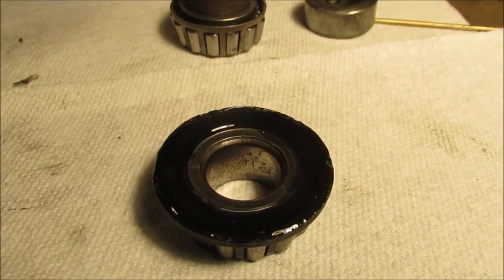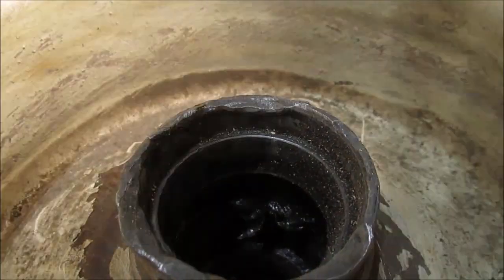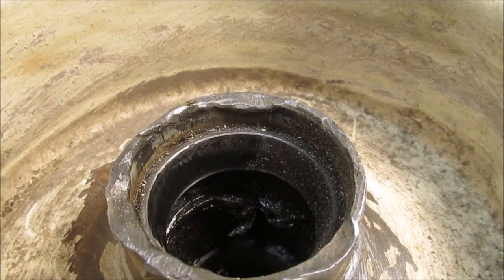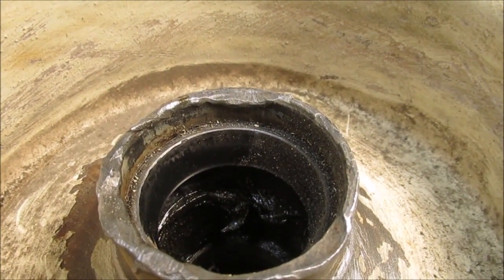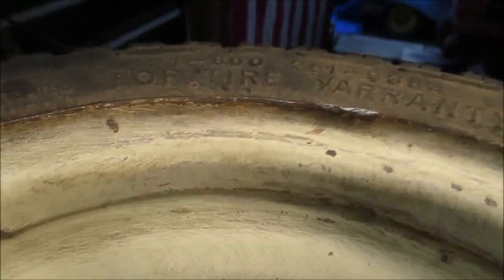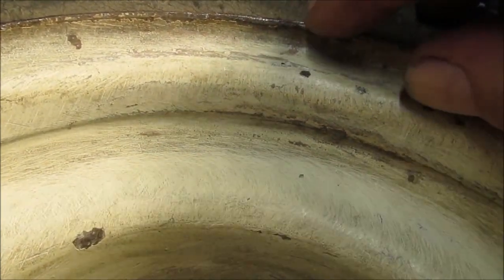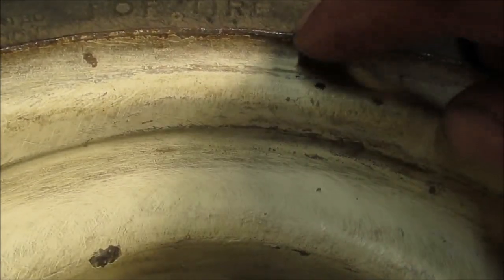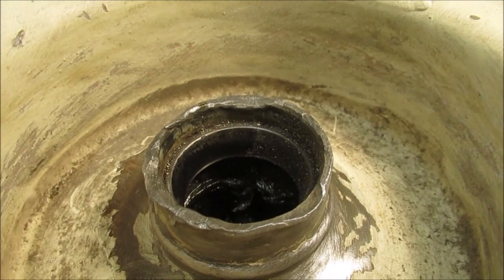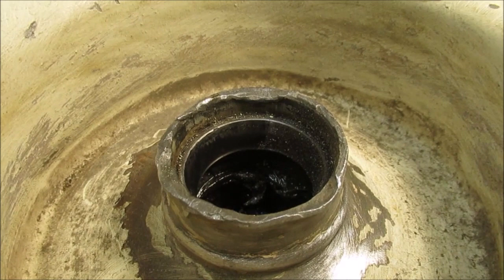We have some damage to deal with — wait till you see the bearing cap. We're gonna drain that out. We may epoxy the cap back in if it's loose — we'll pry it out and do whatever we have to so we can grease it again. We took a ball peen hammer to the rim, then we'll clean that up with a Dremel stone or something so it's not jagged and doesn't cut your finger. We'll bring you back when we get this repair done.